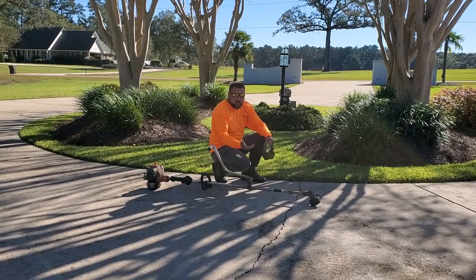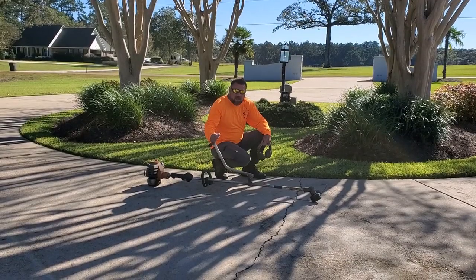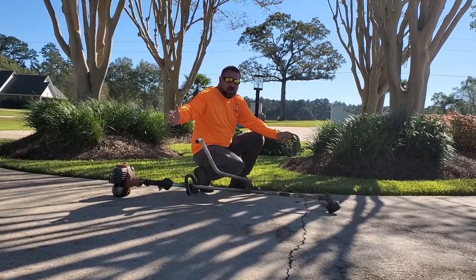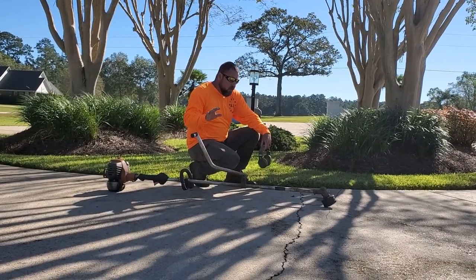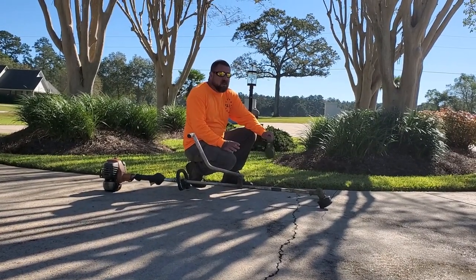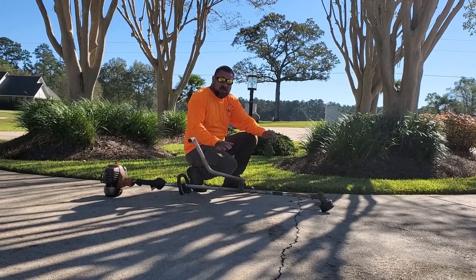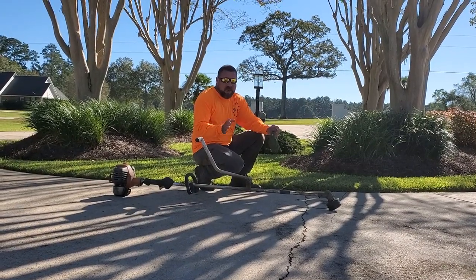Now, the reason I do this and I'm able to do this and be efficient, this Echo 2620T, I can comfortably swing a good 2 feet of string. It has a huge swath without bogging down. The 2620s will do it, but without that little bit of different gear ratio, they won't spin it as fast. And when mowing with the trimmer, you have to spin that head fast enough to keep the string flat. If the string is wobbling, you're going to scalp the ground.